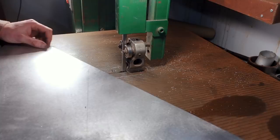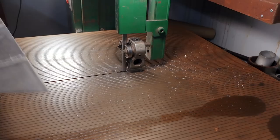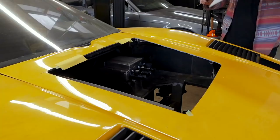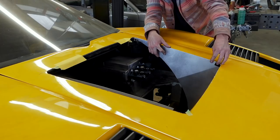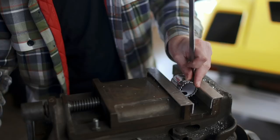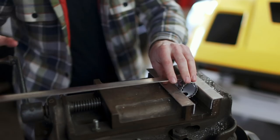I had to get crafty with how to cut these parts on the bandsaw because even though the bandsaw is massive, they were just a slight bit too large for the throat, so I actually had to trace the templates on both sides of the material — the first time I've had to do that, but thankfully it worked and everything still lined up. The only tricky non-straightforward part of building these pieces is the curvature at each end of the panel. The hole we cut in the hood has rounded corners and I want these panels to mate up to those corners seamlessly. To accomplish that, I took each panel and bent it carefully around the saw blade used to cut each corner hole, which made sure the diameter of each piece was correct to mate to its corner — and it worked really well.